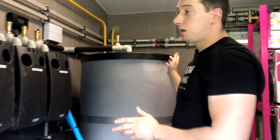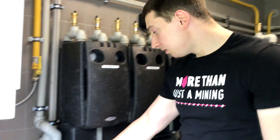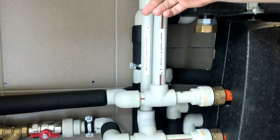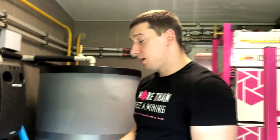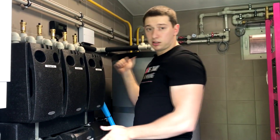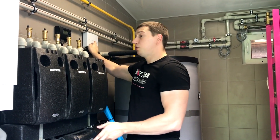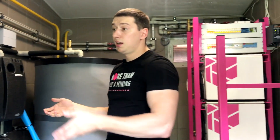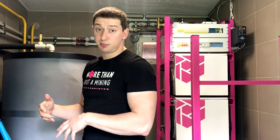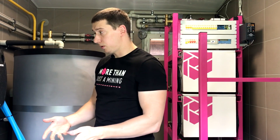The boiler and the rack are connected to the heat supply system in parallel, which means they can complement each other if necessary or work separately. The connection from the rack pipeline is between the boiler and the hydraulic separator. Non-conflict operation of the two devices is achieved using the EA-1 expansion module, which is connected to the boiler automation. If the rack gives enough thermal energy for the needs of the house, it prevents the boiler from turning on. If for any reason the thermal capacity of the rack is not enough, the boiler turns on, while the rack continues to function.